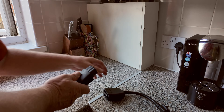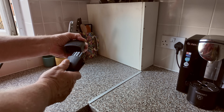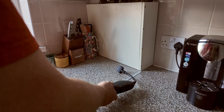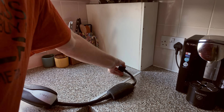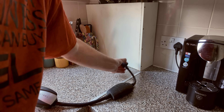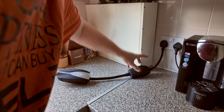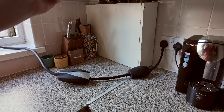This is your level one charger — the charging cable that most EV manufacturers throw in for free. If the manufacturer gives it to you, even if it's free, it's both safe and operational. One end has a big round plug that fits perfectly in your car socket behind the charger flap; the other end has a standard 13-amp plug that goes into a totally normal 230-volt socket — the same one you use for your phone charger, kettle, or TV. No electrician needed, no installation, zero extra cost.